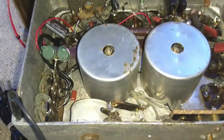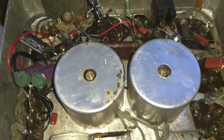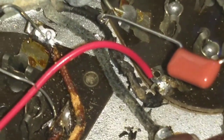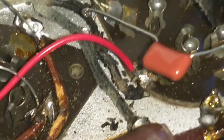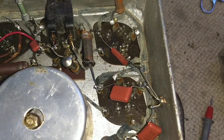Poking around in here, the wiring to and from the field coil checks out. However, what I did find is down in here — see this little bit of frayed wire here — that was touching the chassis, and that was downstream at the second filter, so that was shorting out for sure. I pulled that free and then ohmed everything out again. It appears to be okay.